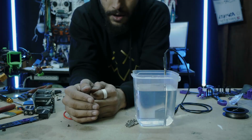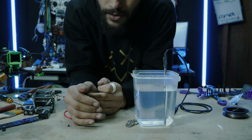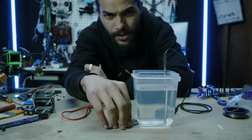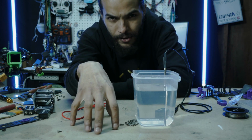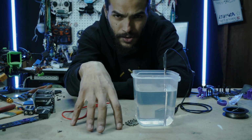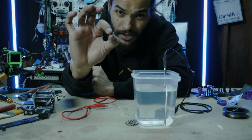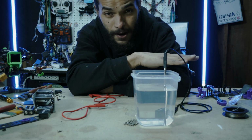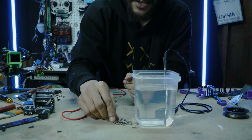And a rule of thumb is if you want a certain color, always use a battery less, because it's going to vary between density of titanium as well. The more dense, it seems like you need to use more batteries to allow it to change into different colors. Or at least the voltage needs to be at a certain point. I found that the same voltage I'm using on these little small ones is not achieving the same color characteristics as the bigger titanium piece. So that's pretty much the end of that rant. On to the next one.